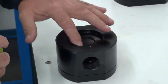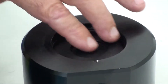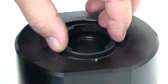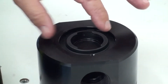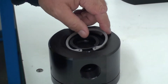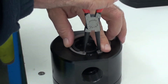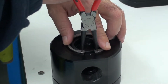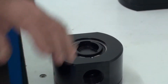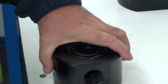This area might need to be cleaned — some solutions may have crystallized in there, dust may have got in, something that may jam up the electronics or your registers. So we just pull it out, give it a clean, and then put it back in. This is done by using a pair of circlip pliers, grabbing hold of the circlip, putting it back into the meter body. That's all ready to go — nice and tight and inspected.